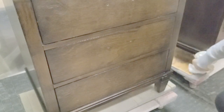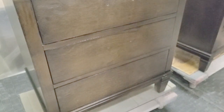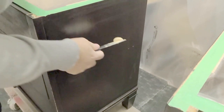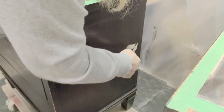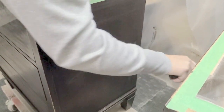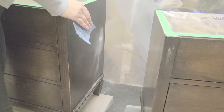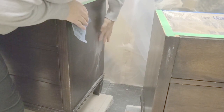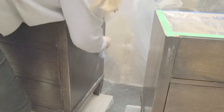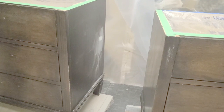I did the cleaning process on both tables. I ended up having to use a little Windex as well because I was running out of Crud Cutter. I then noticed a couple of small dents in the laminate, so I got my DAP wood filler and scraped a little onto those dents so you wouldn't see or feel them. Once it was dry I sanded with 220-grit sandpaper, running my finger over it to make sure it was completely flat — I don't want to feel any bumps.